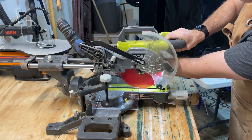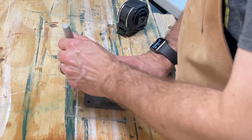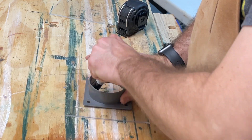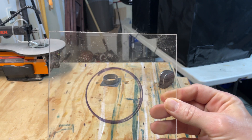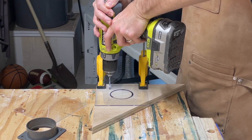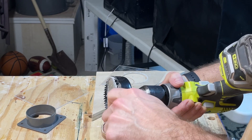This is one of the difficulties of using this type of saw as a left-handed person. I bought this hose mount on Amazon — it's actually an auto part. I marked four holes to screw into it to mount it to the acrylic plate. Basically I had to put the fan between the acrylic and the gray hose mount, and these four holes line up so I just screw the whole thing together. Then I marked the big center hole — about three inches — for the three-inch vent hoses. I clamped the acrylic to scrap wood and drilled out the four screw holes.